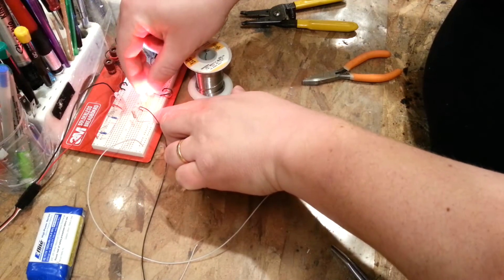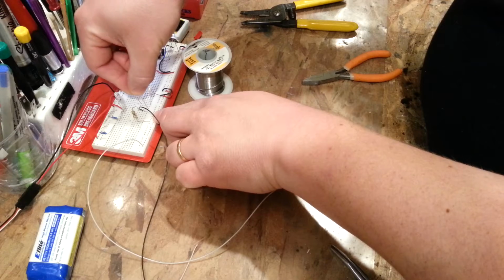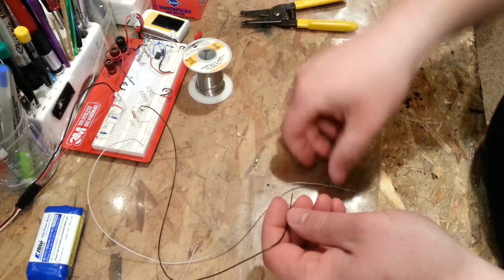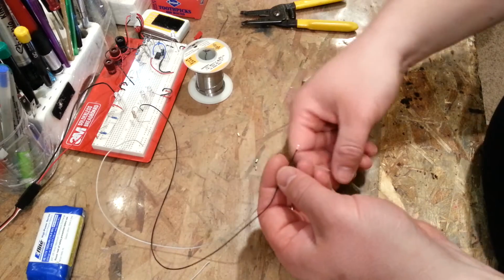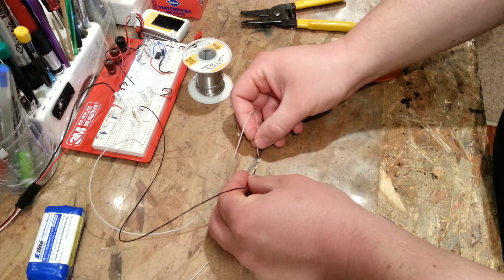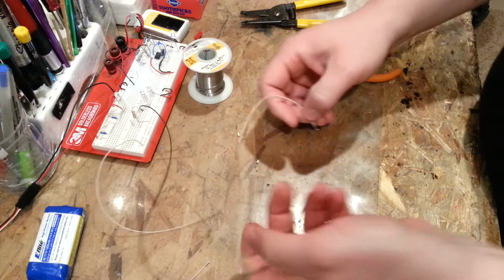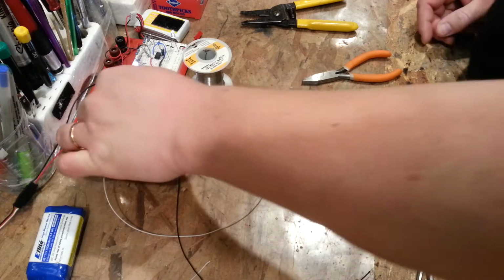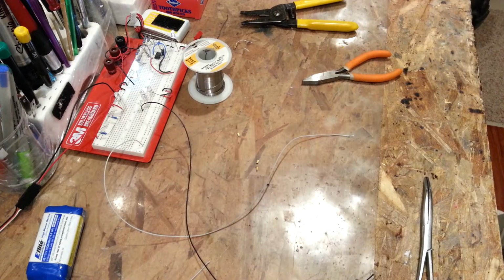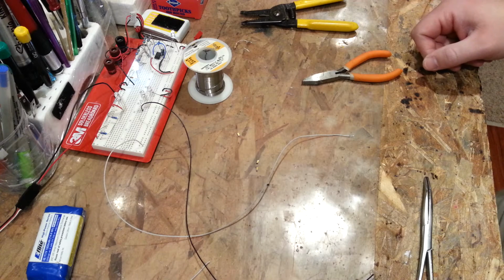So what I can do is eliminate that by detaching that from that rung on the breadboard there. So we'll try this again. So now we're just going straight through the resistor. It should be quite bright again. It's not quite bright. Okay? So now what we would do is get a smaller resistor. I'm wondering if maybe the 3 in series is just a bad idea. Maybe it would be better to just try to do them in parallel like I usually do.